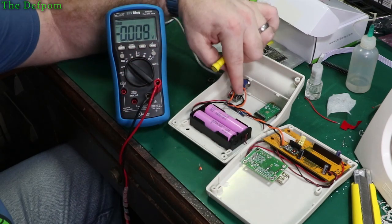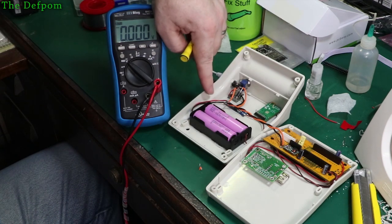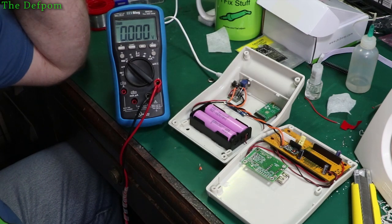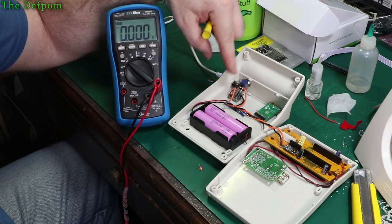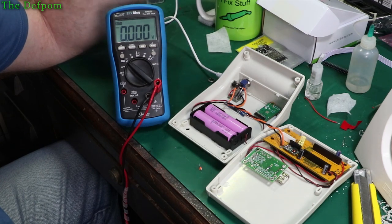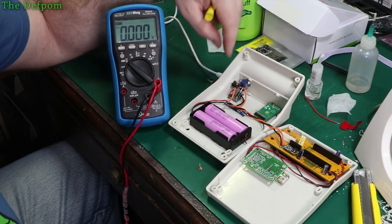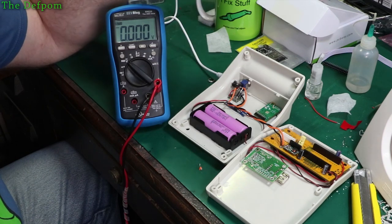So the high voltage in here will come in, that's fine. But the BMS then has to float the negative rail. It lifts the negative rail up to compensate, so it's 5 volts high. It's got to drop 5 volts across the BMS, and that could cause it to get hot. So I'm trying to keep the voltage difference quite low. I'm trying to keep it fairly close, that's why I'm on about 9.5 volts. So I've got about 1 volt extra, which allows for the BMS to actually do its thing and float a little bit without putting too much stress on it. But I think I've got a dodgy module here. And that's really annoying because it takes quite a bit to get this thing in there.